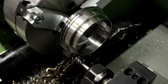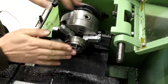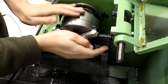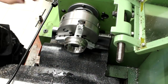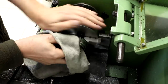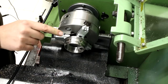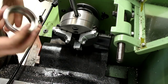This works quite well — not ideal, but better than nothing, and better than hand filing a Higbee thread as described in The Machinist's Bedside Reader Part 1. This side is done. I ran a very fine sanding sponge around it and some Kratex to knock off any hair burrs — now it's safe to touch. We can take the part out and we're almost done with it, except for the back side. We have our blunt start thread in front, but in the back the thread still leads out to a thin piece of material. So we flip it around and use the same soft jaws to hold it from the inside to do the same blunt start thread on the back side.